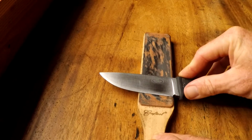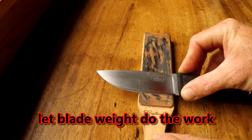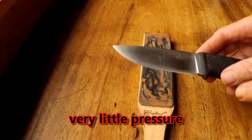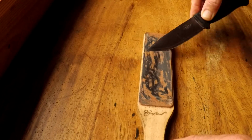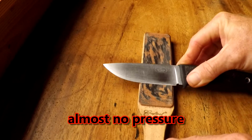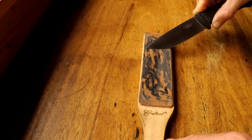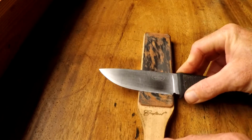Again, lay the blade flat, bring it up to where it's almost cutting the leather right there. Drop it down so it's not cutting, just like that. And depending on the grind of your knife will depend on the angle. And also, if you want to have it a lower angle, you can make your convex edge stronger. That's what I prefer. It takes a little bit longer to get that edge that I like from the factory, and there's all sorts of different factory convex edge types, so it all kind of is what your knife is.